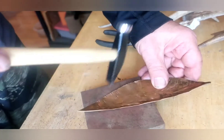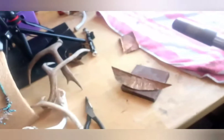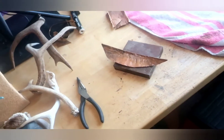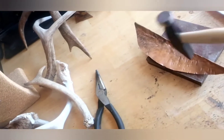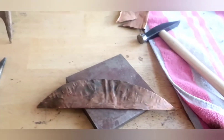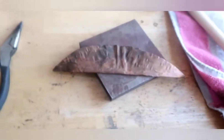When it starts digging into the metal, that tells me I need to heat it. I'll take this propane torch — I usually do this outside, I've got an extinguisher right there. I'll heat that metal up and it will become soft as butter and I'll be able to hammer it and stretch it. I don't want to do it too much now because it looks like it's cutting into the metal and you don't want that. So I'll heat it, cool it off — I'll throw it out in the snow — and I'll do that a minimum of three or four times.